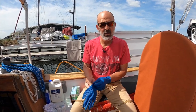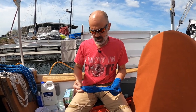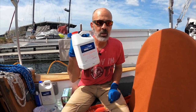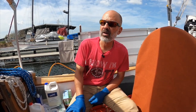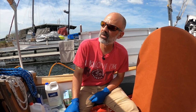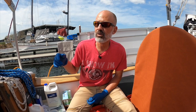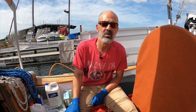Inside the teak hatches, we're going to put some epoxy on there, and then do some varnish over top of that. I'm in a transitional phase due to the fact that we lost all of our epoxy in the shed, so now I'm going to move towards the simpler version of the TotalBoat 2-to-1. Not sure how the UV properties are, but we'll coat it with varnish anyway. The teak will oxidize underneath the epoxy, because that's just what wood does. The biggest thing is the moisture — there was a little bit of condensation still in the corners even after letting it dry out in the sun all day, and it eventually turns the wood colors.